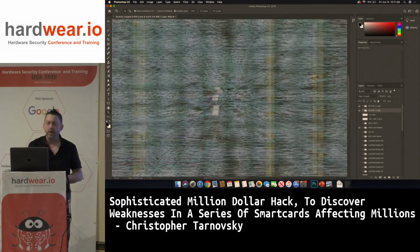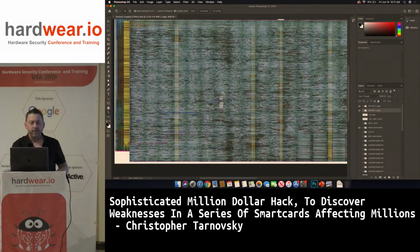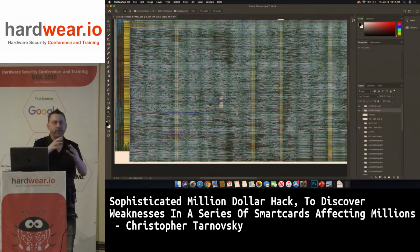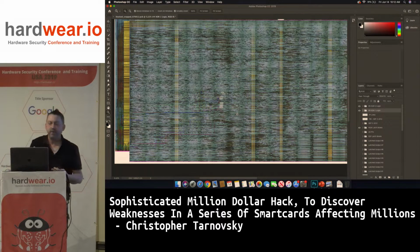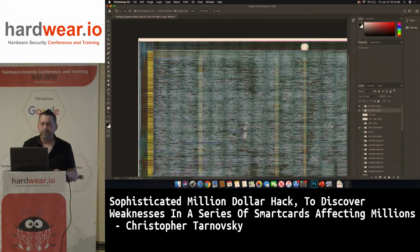So you can see where we are. We're not really on the edge. Usually the instruction register is not going to be dead in the middle somewhere because it's got to decode everything. So it's going to be like in the corner somewhere on the edge. It's not going to be in the middle. Then it would be like a tree, branching this way and that way and this way. So it's very logical, very methodically laid out, even though this is automatically generated with their software when they did their layout.